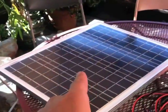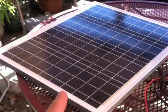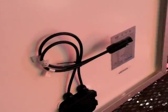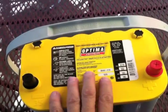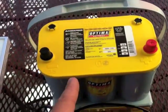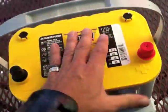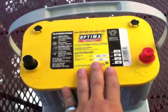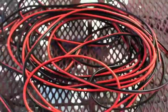I'm going to give a definitive step-by-step on what you need to purchase and how to put it together. This is a 50-watt solar panel — I got this for $90 in the mail, and you can see the connectors on the back. Then there is the deep cycle battery, about $200 including shipping. You can also get these at AutoZone. These are ones you can tip over without leaking like a typical car battery. This is obviously the most pricey and most important item. Then we have 10-gauge wire.